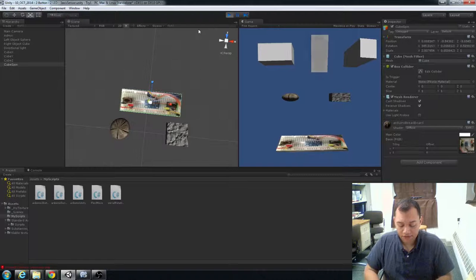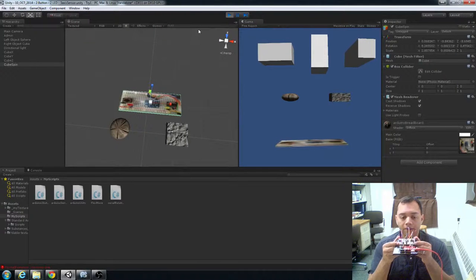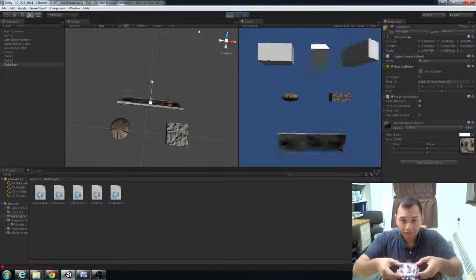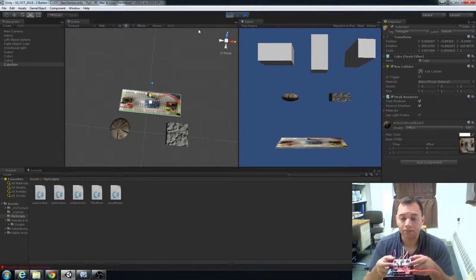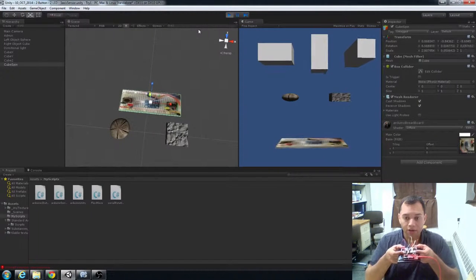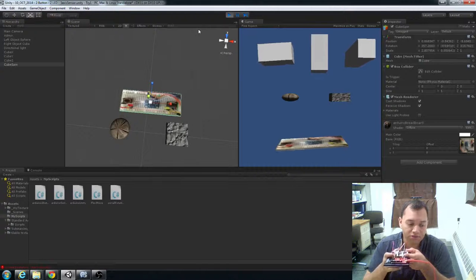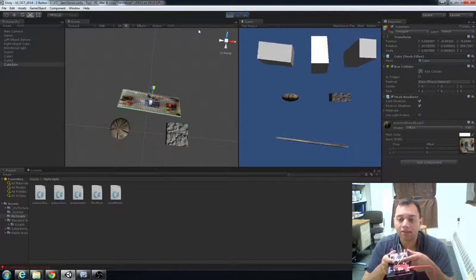And again, just to point out on this accelerometer thing, if you can't see this right now, I'll try and do it as best I can. See, I'm not actually rotating this right here. If I rotate it toward me or away from me, you see my objects in the game screen rotating. But watch this, if I just slide it forward, you see, I didn't actually rotate the thing. All I did was go forward, but I created acceleration along one of the planes, and so that actually created a rotational value, which is not something that we want either.